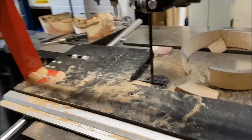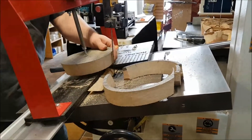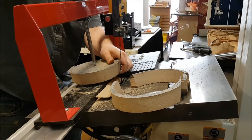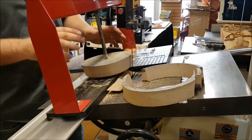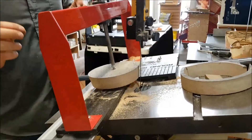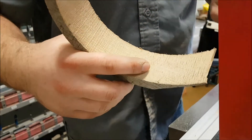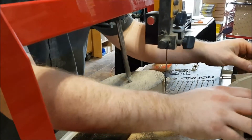Here's my piece of wood, we'll throw this back in my round ripper and we will make another cut and see how we did. Now this cut isn't going to be parallel with the last cut I just made, because that last cut was not a perfect circle. But now that we have this aligned, we should be able to cut a whole lot better. When you do have this set up incorrectly, it's very hard on bandsaw blades - it binds them quite a bit, so you got to be careful. You're liable to wreck the set really easily, so make sure you have it set up properly.